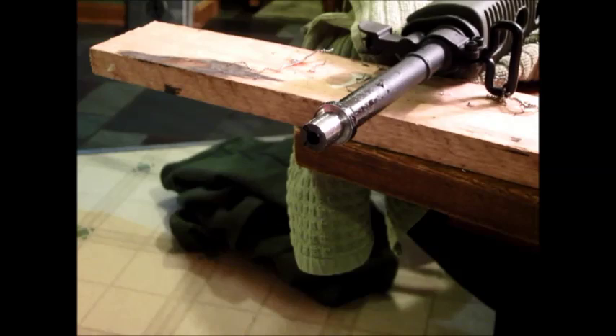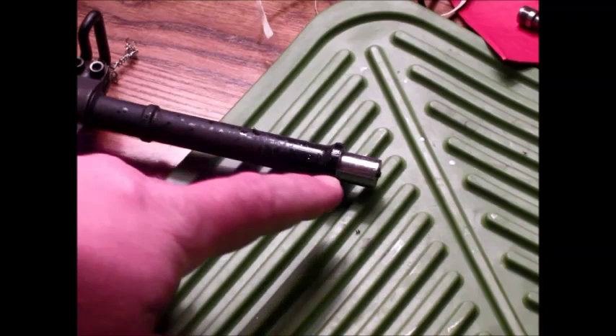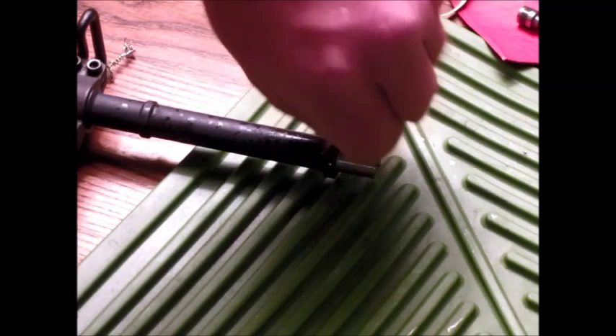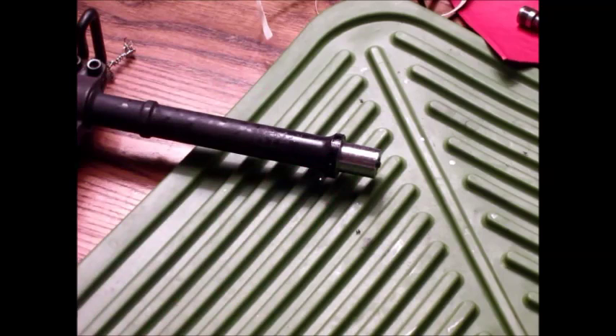Getting very close — probably just one more cycle of cleaning and oiling and I should be done. As you can see, I've got about 5/8 of an inch of threadable shank right here, coming up to about 1/8 inch. I need to peel off this tape — well, I'll peel it off later — 1/8 inch of shoulder for which the muzzle device can be tightened against.